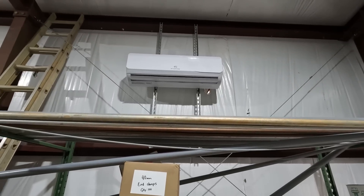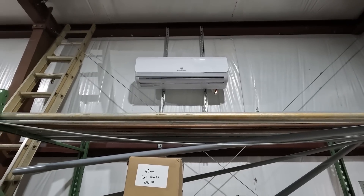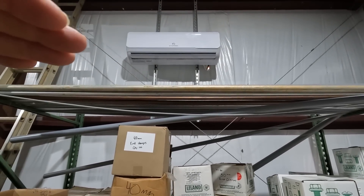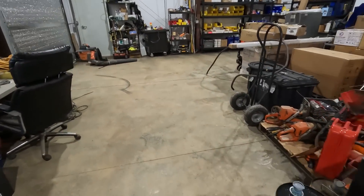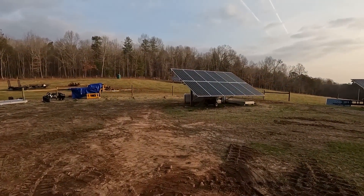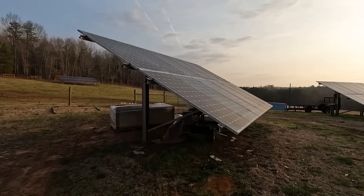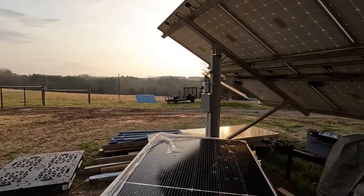Just like a normal mini split installation, I like to mount the indoor unit first because that kind of determines my line set position — the length of the line set, how high I need to put the unit, and location. Then I can adjust the outdoor condensing unit to try to use up that line set. This line set comes in a coil, it's about 13 feet long, and it actually does come with the unit, which is nice. I just unrolled it to see how long it was. You can mount your panels any way you want — I'm repurposing a ground mount from my old Outback system for these product reviews.